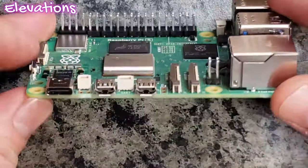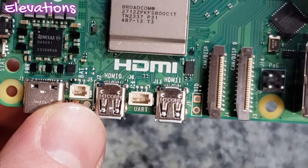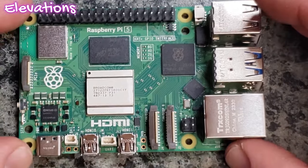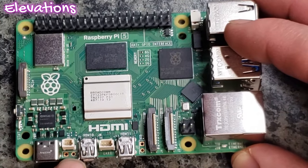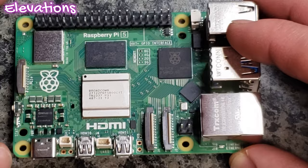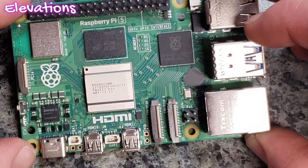Let's go ahead and rotate. I did notice we do have that UART port. It is labeled J5 for a battery right there as well, so you can plug in a battery directly to the Raspberry Pi. Now I do not know for certain, but it looks like we do have open holes, so it is very possible that we can solder directly into that and solder into a battery circuit, as opposed to connecting with the J5 port.